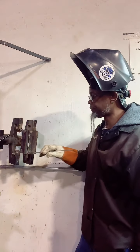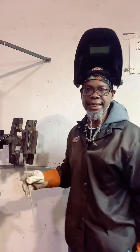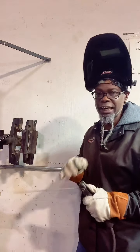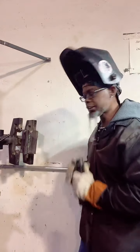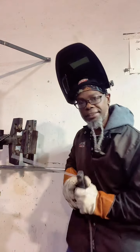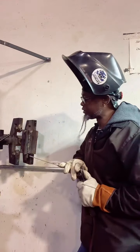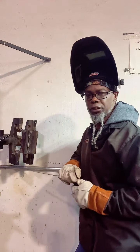We're gonna do another one, and on this one I'm gonna do a different technique than I did the other one. Yes, a tight arc is really gonna help you out. Keep it as tight as you can, fam. And get comfortable. Make sure everything is good before you start. You hate to be stepping on something doing this. I've been there. So that one was a slight C motion. We're going to switch it up and I'm going to do something different on this one.